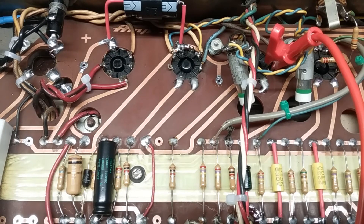To get our plate current, we divide voltage by resistance. That gave us one reading of 39.4 milliamps and the other at 50 milliamps. We measured our plate voltage at 497 volts. Multiplying 497 volts by each plate current, we arrive at a plate dissipation of 19.58 watts for one output tube and 25.04 watts for the other.